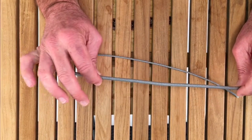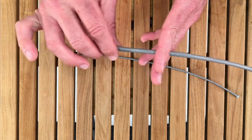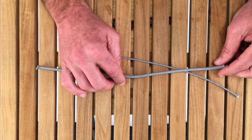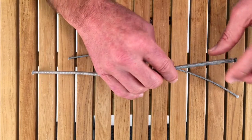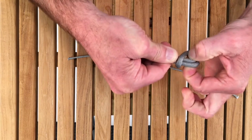This has a very long service life, it holds up well to abrasion in the stanchions, and it gets rid of a lot of hardware. We would typically take all of the wire and wire fittings off. Using your measurements, we would put an eye splice in the front, and that would get luggage tagged to the front stanchion.